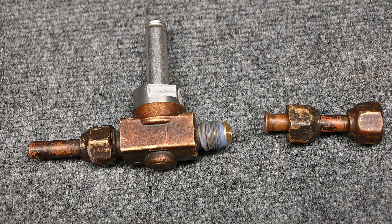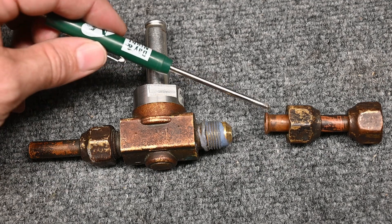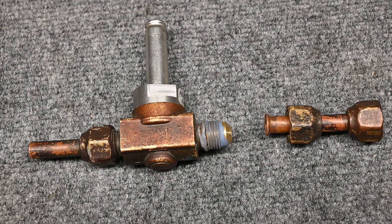However, we do still have to worry about this fitting being done correctly. People either love these or hate these. The good news is you don't see them with residential AC. They are still used pretty heavily in commercial, and they're now being used pretty extensively with ductless. The key with all the flares is that the flare we do in the field needs to be done correctly.